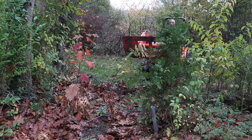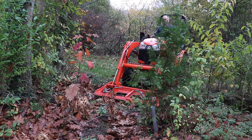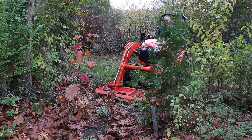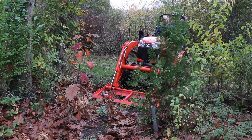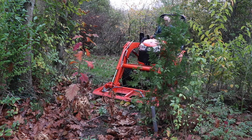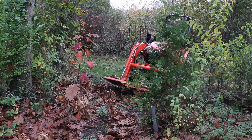But for very thick roots that can't be cut directly this way, the teeth at the top side of the ripper can be used to grasp the root. By then simultaneously making small forward and backward movements, and thereby also using the traction of the compact tractor to create a horizontal force as well, these thick roots can be loosened within the ground, making them much weaker, and can then be broken up using the teeth on top of the ripper.